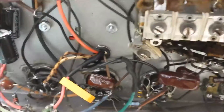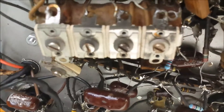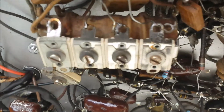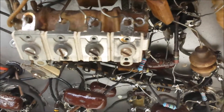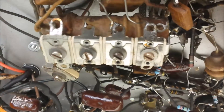You adjust that one down there, this one up here, these three or four down here, and then these three. Usually there's two of them for each band. We went ahead and ran the alignment on that, and everything came out pretty close, or as close as we could get it. I did have to replace one screw that was rusty — pulled it out of a donor machine — on the fourth band, which was really touchy, and the head was kind of stripped out.